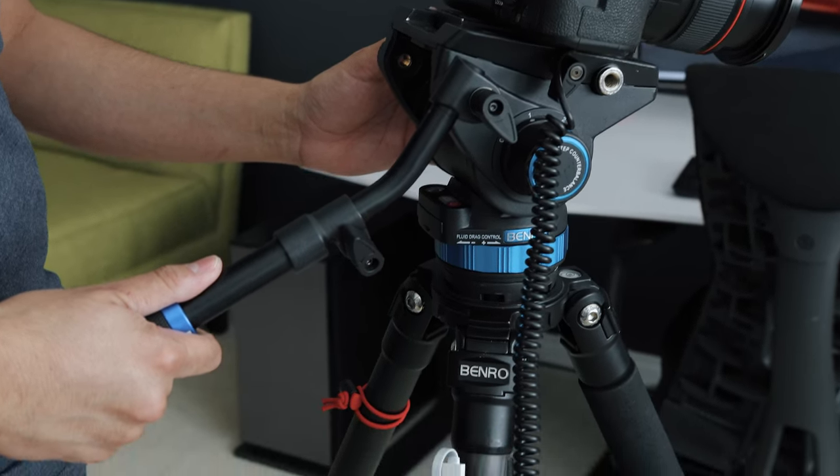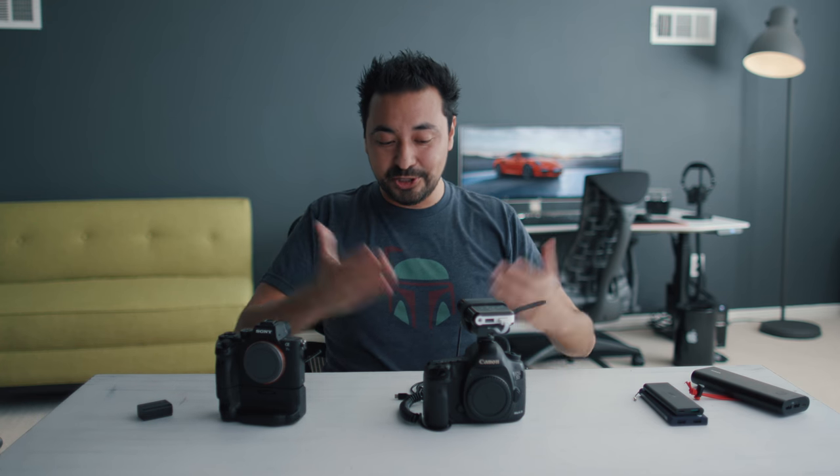You don't necessarily have to mount it up top. If you have a cage, you can mount it on the side. If you're on sticks for most of the day doing interview style, you can strap a 20,000 milliamp power bank onto the tripod leg. This is a much more effective and lighter solution compared to a battery grip, which is heavier and bulkier. The only thing you have to keep in mind is that the power bank must output 2 amps — that's it. Something like this, including the power bank, will run you about $80 or even less depending on the size, and you likely already have a power bank at home, so you just need to buy the module.